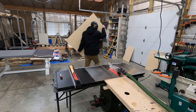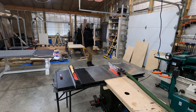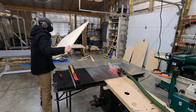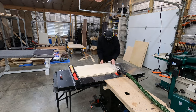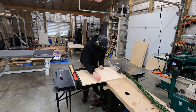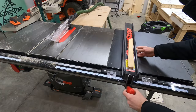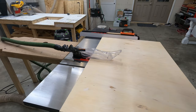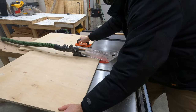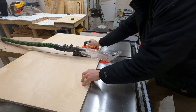The first thing I needed to do on this set of cabinets was to rip and cross cut all of the scrap plywood to get everything broken down to size. The plywood I have here is three-quarter inch thick birch, and I'll be using this with dado groove style joinery to put everything together. Each piece of the cabinet except for the doors and the face frame will be made from that three-quarter inch birch.